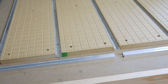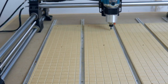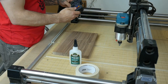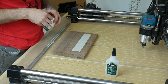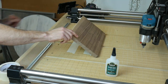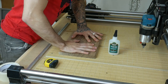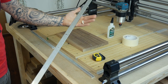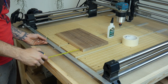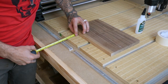I'm going to walk you guys through how I attach things to the CNC most of the time and a few ways to square your pieces on the machine. CA glue is my go-to lately. Ben Meyer showed me this trick and I've been hooked ever since. You put two pieces of tape — blue tape, masking tape, whatever you've got — two pieces on each side of the CNC. Make sure they line up, add a squirt of CA glue on each piece, and this thing is cemented to the wasteboard. If you have a straight edge, a long square, or a level, you can butt it up against the front of the machine and get your measurements off that if you don't have a grid pattern. You can also measure off the T-Tracks or the front of the wasteboard.